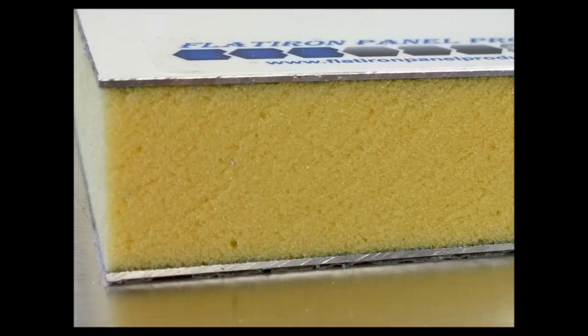Polycarbonate panels are dent and moisture resistant. Polyisofoam core is a closed cell substrate that is water and fire resistant. Polyisofoam core can be used in internal or external panels due to the R factor. It is commonly used for external cladding in commercial buildings, elevator cabs, and the marine industry.